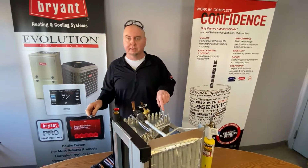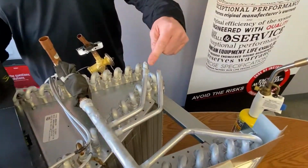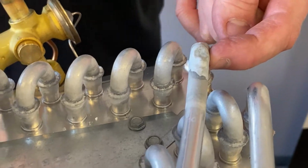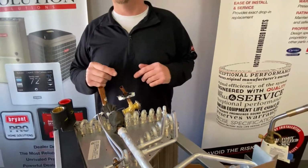We did one over here that was a massive hole. You can see this one over here. This one here was a really large hole. You can see how large it was. We filled that without filling the inside of the pipe with this same kit using the Alcorp rod. But you can make a repair on these. It's not that hard to do.